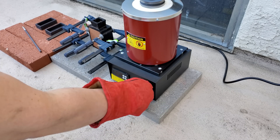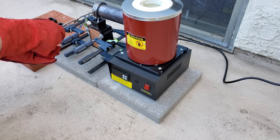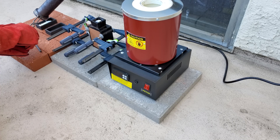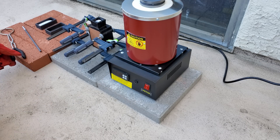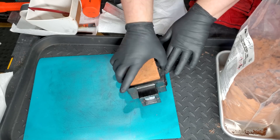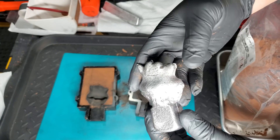The aluminum actually melted very quickly. After the aluminum had melted, we used a graphite stir rod to mix the molten aluminum and check for dross. We poured the molten aluminum into the mold using the included tongs. The excess aluminum was poured into a bar graphite mold. After the aluminum cooled for about an hour, we separated the flask and you can see the results we got.